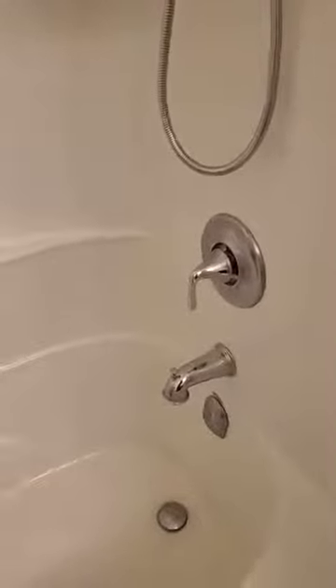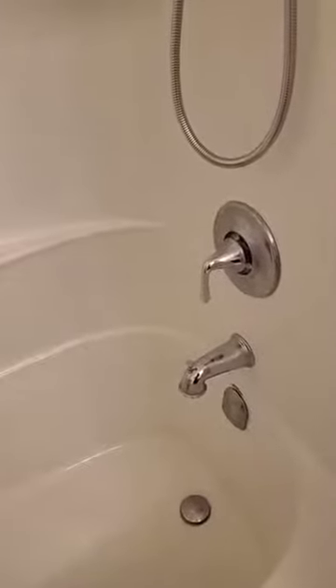We are good to go. One thing I'd like to mention is that my spout is fairly new — only four years old — and the rubber inside was in really good shape. All I had to do was a little bit of cleaning, wash with water, and rub it with my fingers and the scale went away. Now if your rubber seems really old and isn't round anymore, and has a lot of chipping on the edges, you should purchase a repair kit. I believe Home Depot sells these for a couple bucks, which is certainly cheaper than changing out the entire spout.